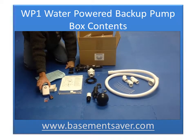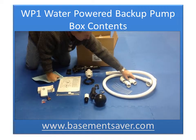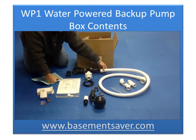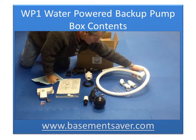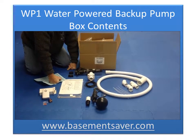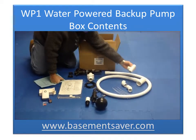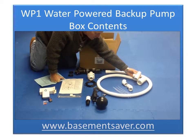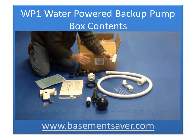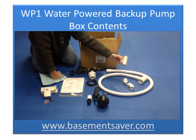There's the free Basement Saver water alarm that comes with the unit, and there are some other fittings here. Over on this side, we've got a flexible hose to use for discharge. This connects onto the front of the pump, and this fitting here allows us to plumb the discharge into our existing main sump pump discharge if we wish to do that. This is a different fitting that would go on the end if we're running a dedicated discharge for the pump, and this is a relief tee. So if we ever get back pressure or blockage in the line, this will pop out and allow the water to relieve itself into the yard and not cause the pump to back up into the home.